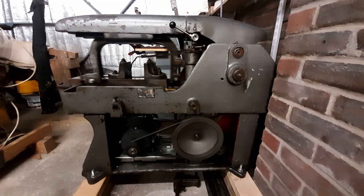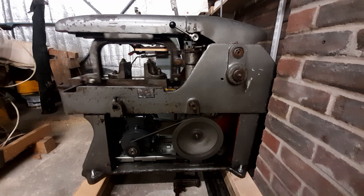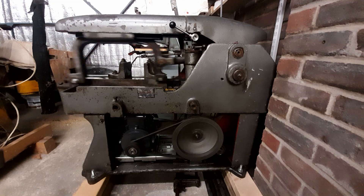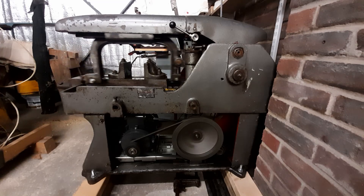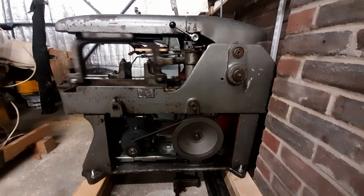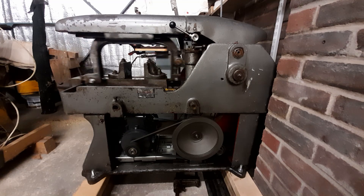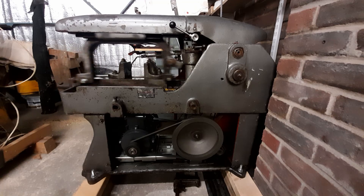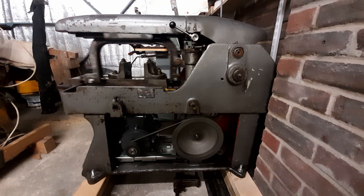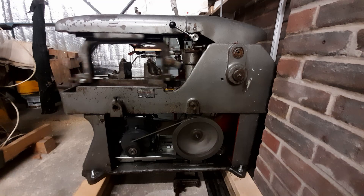You'll notice that I've mounted the saw on a couple of wooden skids. I did have some thoughts about sticking it on casters, but I'm glad I didn't. I've made the skids relatively high because I've got a mechanical pallet truck — not a normal hydraulic pump truck, just a mechanical one. It's either fully down or fully up, and the up position is quite high. If I made the skids quite thin, although I could get under the machine, there's a risk of it toppling. The truck is rated for something like 250 kilos max, and this saw weighs 340.